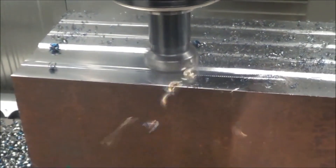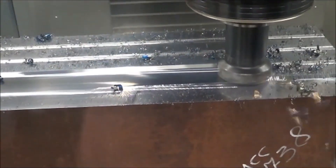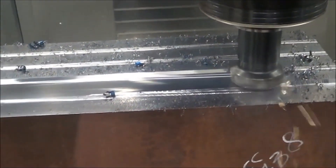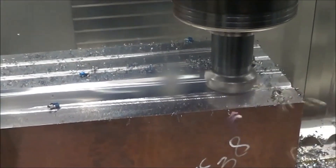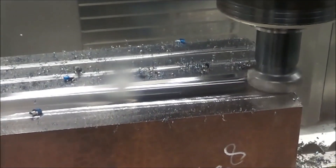Also controlling things like the growth of the machine, linear scales, making sure that the kinematics — where the machine moves — are continually fed back to the control in order to give you the optimum in precision and accuracy. So it's compensating for any deviations. That's really what you need to do with a machine of such a size. You need to continually feed back: am I in the right position, do I need to move slightly? And that is happening with infinite movements.